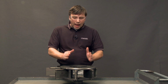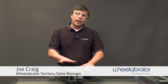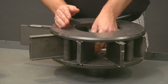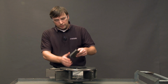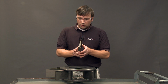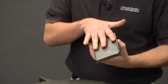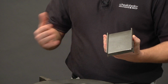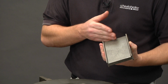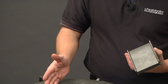All right. In higher horsepower applications, Wheelabrator recommends a 3.5-inch wide bare wheel and blade set. The reason is that with a 3.5-inch wide blade set and the double-sided bare wheel, you support it on both sides for applications of 40 horsepower or greater. You have 40% more surface area over the 2.5-inch wide traditional Wheelabrator blades. This provides longer life and greater coverage in the abrasive blast pattern.